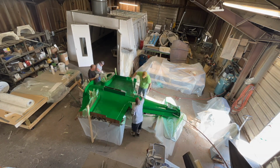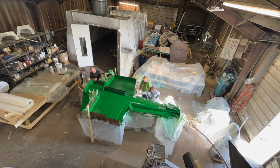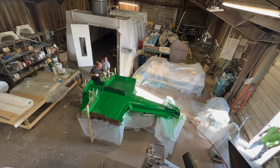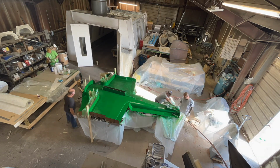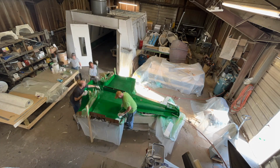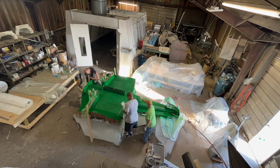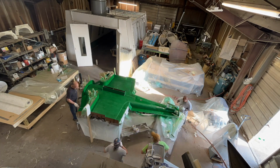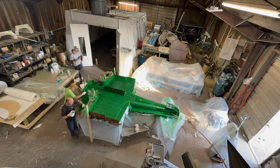What we'll do is, it took 4 hours to put on 1 full layer of fiberglass. We let it cure. Next day we do it again. Next day we do it again until we have 4 coats. And then we'll create a steel frame for this fuselage and be able to take it off the mold and flip it all over and then start on the top. That'll be occurring over the next few weeks.